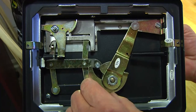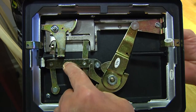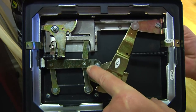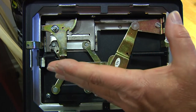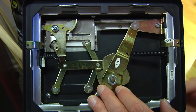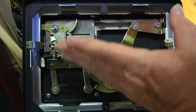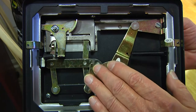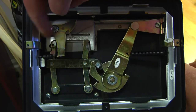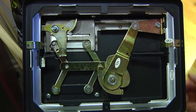I thought, if I can stop it right there so it stays in contact — because before, this thing would keep going all the way over the side and have wiggle. It would be that far apart, even through this motion right here. It was away from it, so this had all kinds of wiggle room. What it was doing is it wasn't closing enough to meet up. When it would squeeze the tobacco and kept going with wiggle room, when it met the tobacco it would come back a little and move away from the exit nozzle, which was pushing the tobacco up against the wall, making it back up and log-jam. Ever since I put that little pad right there, the cigarettes are perfect.